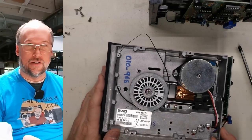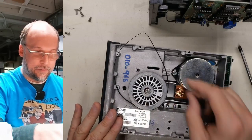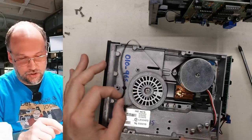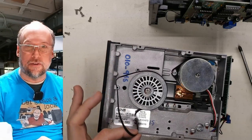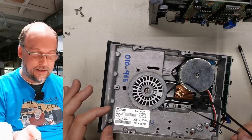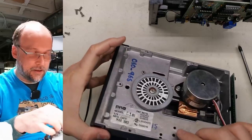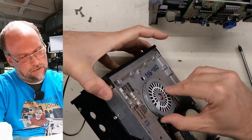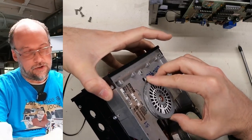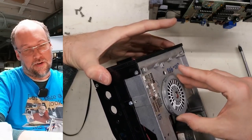Okay, I wasn't going to show working on this other drive. Now, when I took the cover off, the belt was on normally, but I have to say this belt is actually stuck onto the spindle. Now, it's not stuck badly, but as you can see, it is stuck. So some good cleaning is going to be necessary, and possibly, yes, look at that spindle. Oh, okay, it's also very stiff and hard to turn. Let's open the mechanism. Oh yeah, it's still pretty hard to turn.